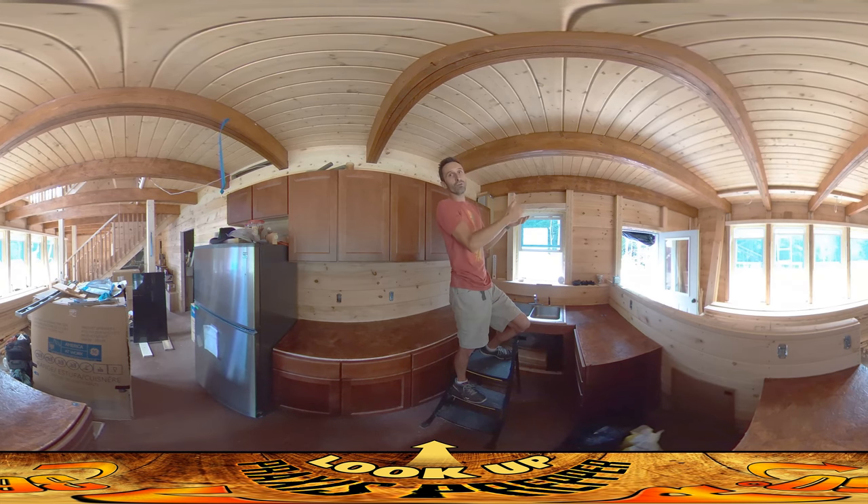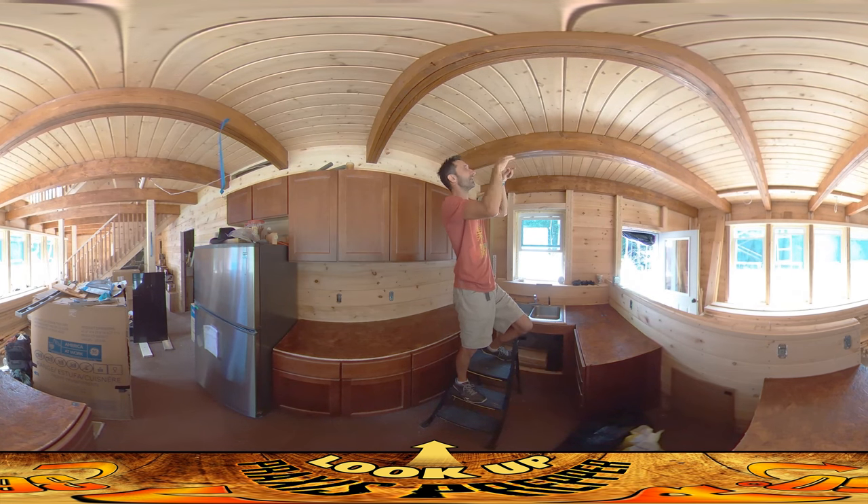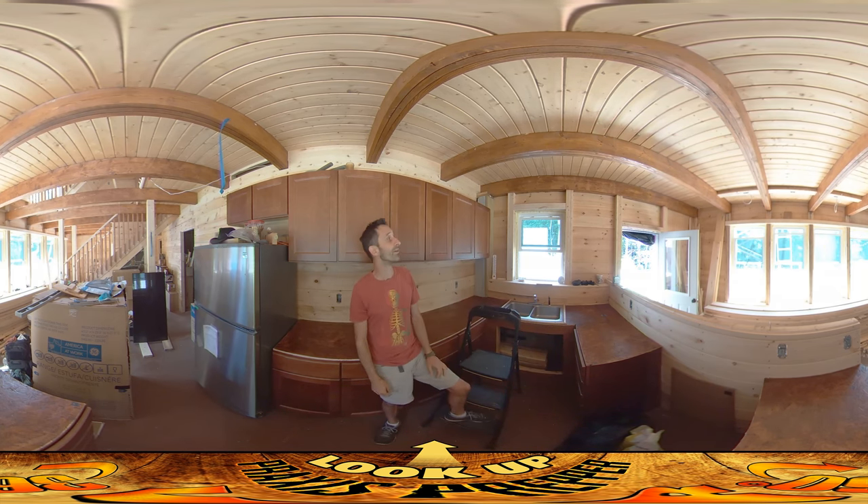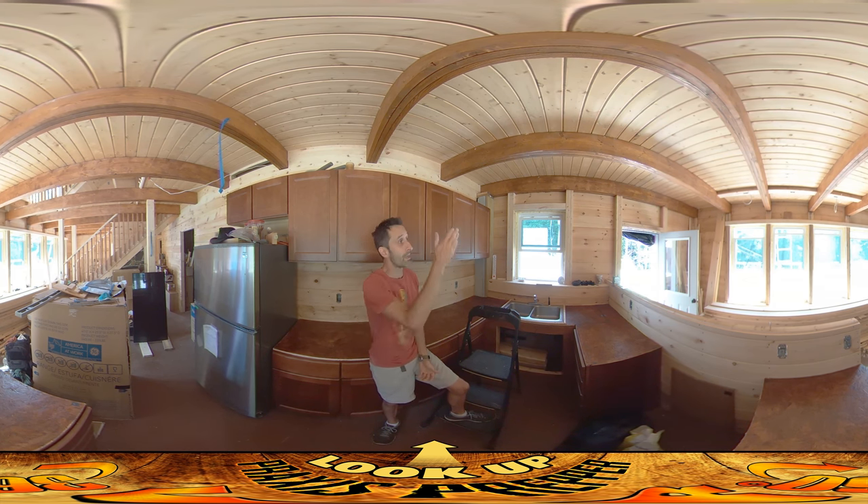It's kind of unfortunate — bumps me out because I was actively trying not to do that. But what I'll do is take a piece of lumber, whittle it down — it's like a five-eighths inch hole — whittle it into a little peg, cut an angle on it, glue it in there, then do wood putty first and stain it. So that's where things are — working through the electrical stuff, getting this kitchen area together. Writing notes for yourself on the wall as you're working on multiple projects helps you jump around and remember what was in your head. That's it, thanks for watching.